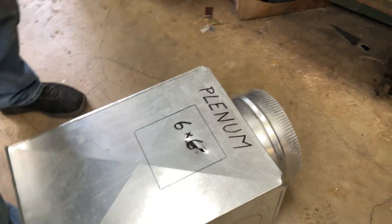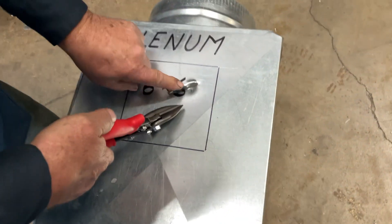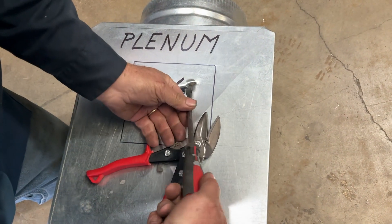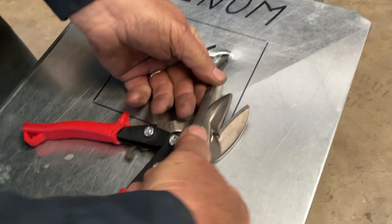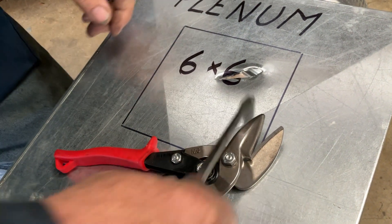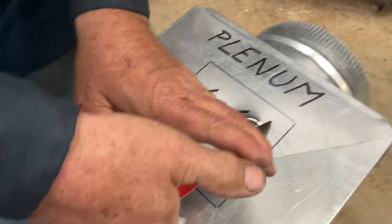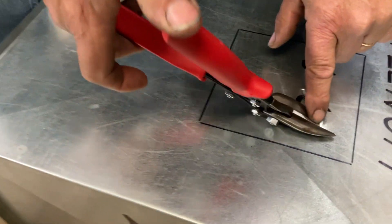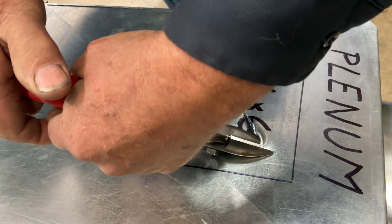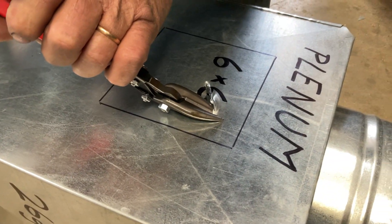Most sheet metal work is done on the floor anyway. Now the part that I twisted — the reason I twisted it was just to open up a gap. I'm just twisting, not pushing. Now we're going to start right here with my reds — I'm going to stick the snip into that place where I twisted and cut a hole.